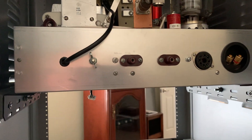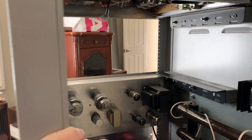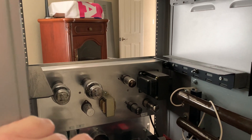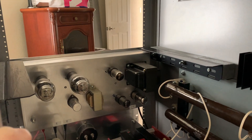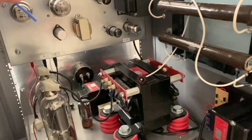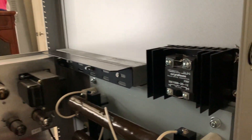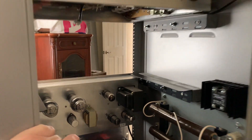I still have to add the extra dropping resistor in the bottom part of the RF deck for the screen. I've taken out the exciter rack — I've got to add a couple of extra things I'm going to do to that. I'm changing the cable. I'm going to wire up that relay like I originally planned so it doesn't click when I go just to spot the thing. I'm tired of hearing the whole thing click where I've got to turn the plate switch off to stop it — it's just irritating. So I'm going to get the modulation transformer reconnected, get the limiter hooked up, get the supply outputting through the relay. The exciter deck — that RCA jack on the back — it's going to have the 12 volts out on transmit to control this relay. So I've got to make that connection and rewire a couple of things on the bottom of that deck, which is why it's out of here. And I've taken the back door off.